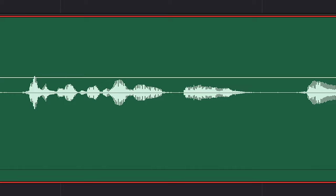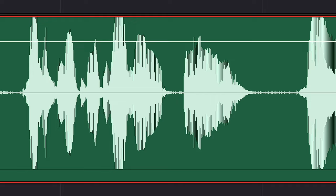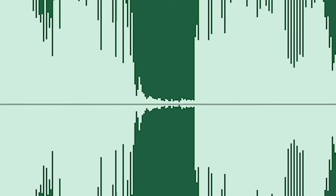If you're in a situation where people are just talking, even if they yell or there's loud noises going on outside, you won't clip this or the mic that is included in it. I noticed that even when things were very quiet, when I brought the levels up, it seemed different than when I brought levels up with non 32-bit float audio. It's kind of like the noise floor, if it's even called that, kind of stays where it is. So there were multiple times when somebody was mic'd and somebody they were talking to is not mic'd, but you can still bring up the person that was talking that wasn't mic'd.